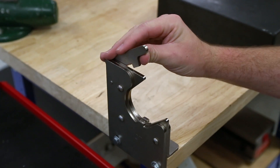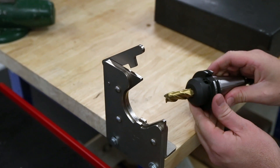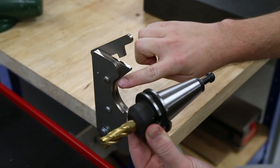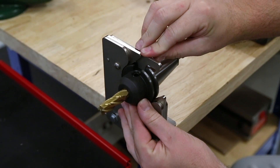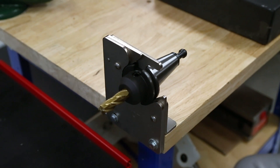Let's take a look at loading tools into holders now. Here's a bench-mounted tool loading fixture. Notice the triple plate construction designed to capture the flange on the tool holder. The groove on the flange should align with the center plate on the fixture. Rotate until the notch aligns with the fixture tab and pivot the upper locking arm to a closed position. Notice the tab is fully engaged with the notch.